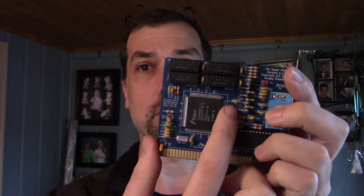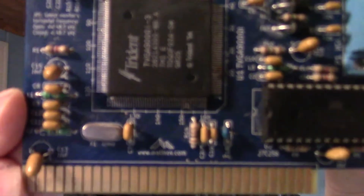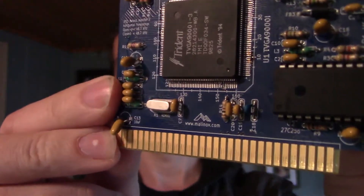I plugged this thing in at first and saw that mess on the screen — I was not happy. I took a break for a while, did some other things trying to regain some confidence, and made it work. I am not going to touch this card anymore — this is how it is going to look for quite a while. On this side and on this side there are some messed up pins, and there it is — it's working. You saw all the diagnostics pass. I'm actually kind of afraid to clean it up anymore. But we got it working and that's really all that matters — we can continue forward on our journey of building out an XT compatible computer.